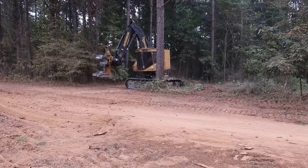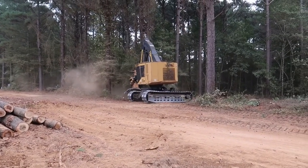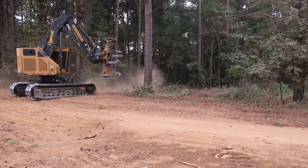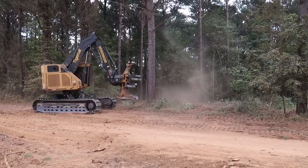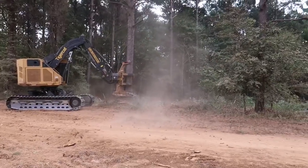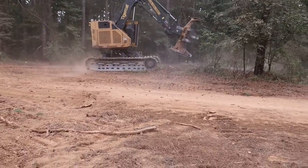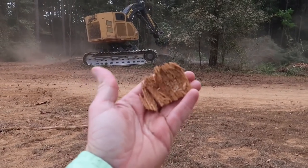Before he cuts that tree, he'll lean that head forward just a little bit so the top heel of that head will touch the tree first, and then it will start pushing the tree over a little bit before he ever touches it with the saw. That way it guarantees the tree is going that way. If you hit it with the saw first, it can flip right back over the top of you or to the side of you. See him lean the head forward. He's still about to let it get away from him. Y'all see that? That's a heck of a wood chip.